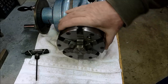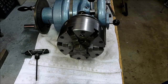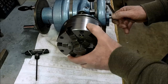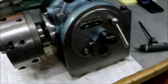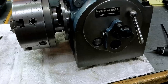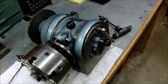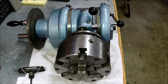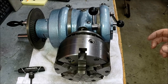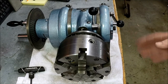This has been a fun project — it's been a lot longer than I anticipated, but I'm happy with the results. One other thing we still need to deal with: we still have a temporary plug where the sight glass goes — that's actually just an oil drain plug for an automotive oil pan. One of the viewers is working on making a slug and he's going to send it over. He's got a piece of acrylic that he's turning and he's going to thread it, and then I'll finish machining for the depth and maybe put a little crown on it for a lens. We'll do an addendum on that as well.